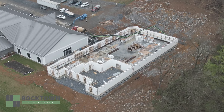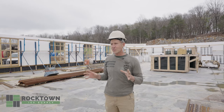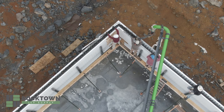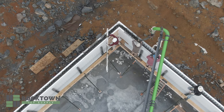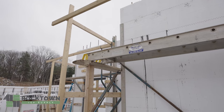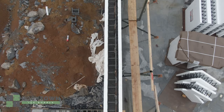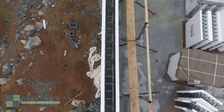In this large commercial building, not only is there a huge volume of walls to do, but they also go 20 feet up. So we decided to only pour halfway this time and then brace, bring the bracing and scaffolding up to the upper levels and pour that at the end. Within a day, the walls are not going to move if you take the bracing down.